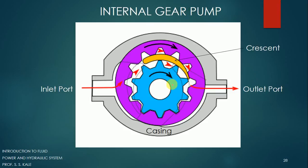With the blue color we are having the external gear tooth, and this purple color is the internal gear tooth. Now this internal gear and external gear, they are in mesh only for this particular part. Only three teeth of the external gear are in mesh with the internal gear, whereas the other part is a blank one. The most important part is called the crescent — the yellow color element is named as a crescent.